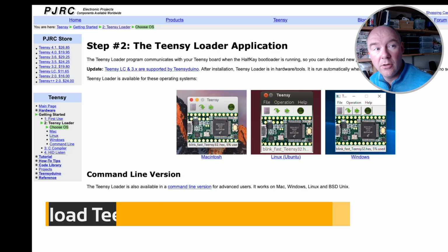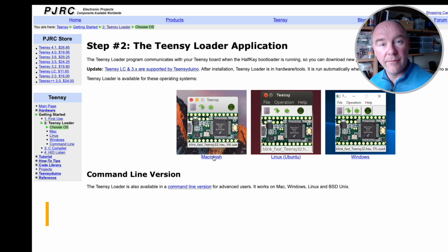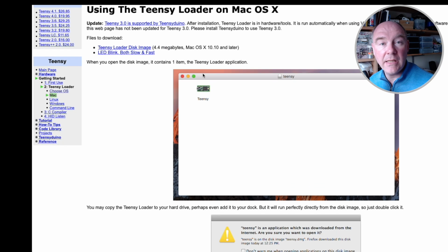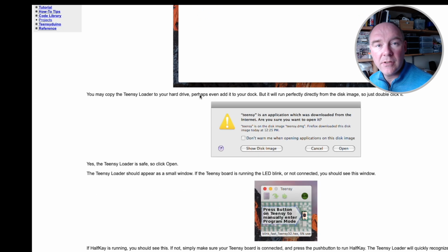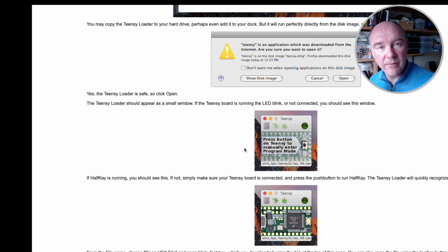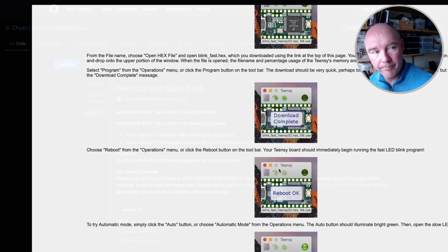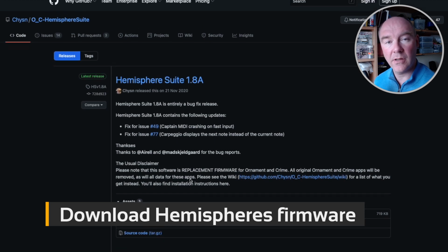The first thing we need to do is download the Teensy Loader application. This will install the firmware on the Ornament and Crime. Follow the link I've included down below in the description, and you'll see on the website here that you can actually choose the download for Mac or Windows or Linux, and it gives instructions on how to load the image file into the loader and then click the button, which I'll show you in a moment, to download it into the Ornament and Crime.